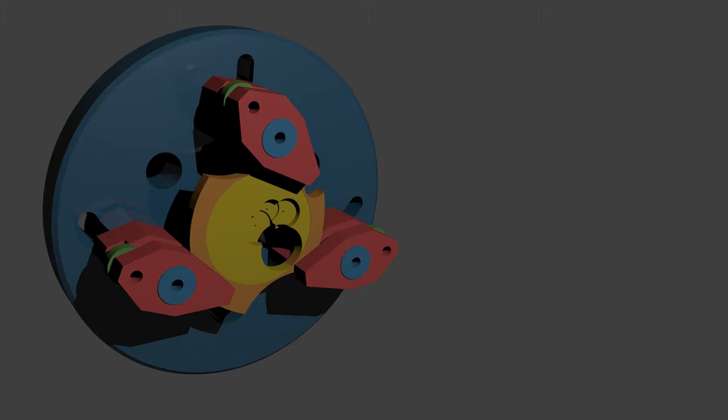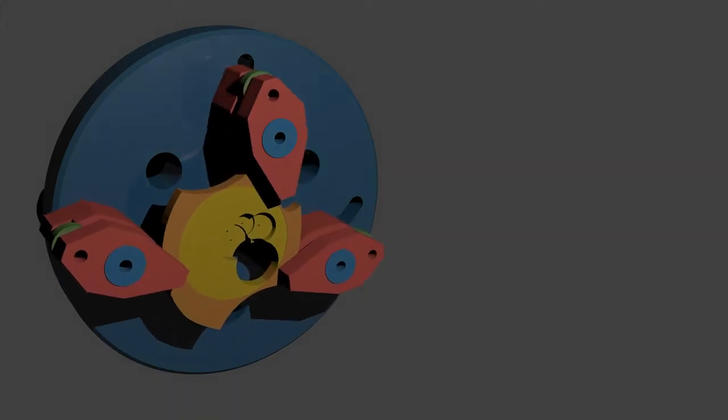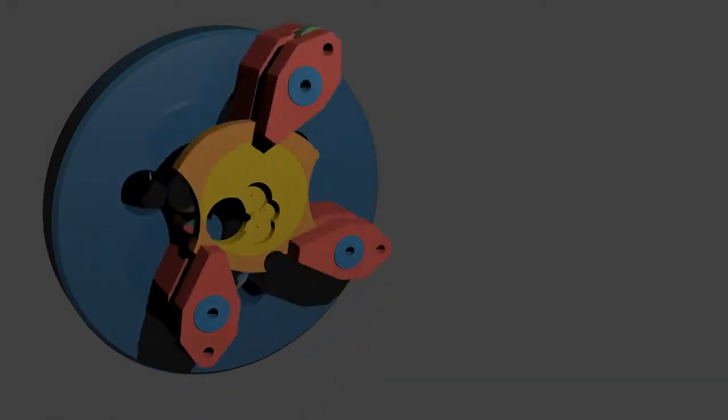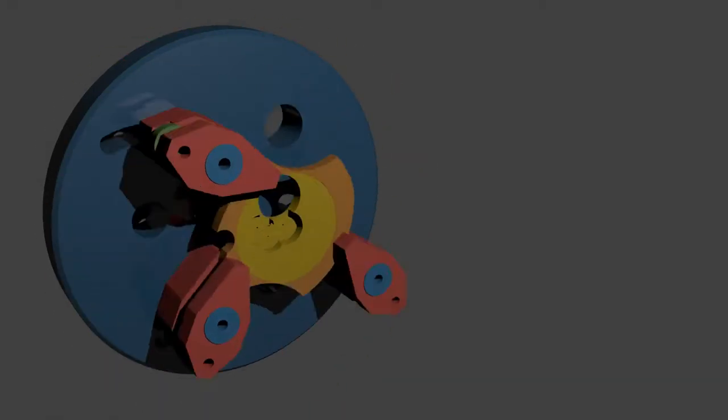To machine the next feature, the part is moved to a new location and the clamps adjusted to hold it, once again avoiding any pressure on the features of the plate itself by clamping on the flanges.